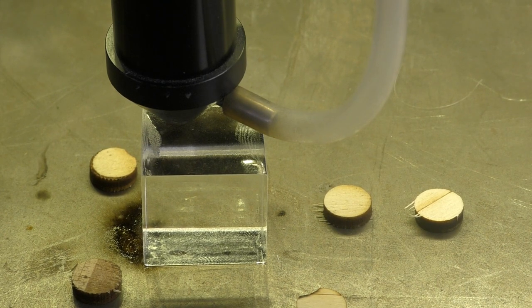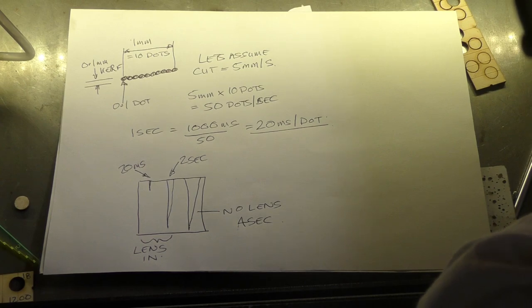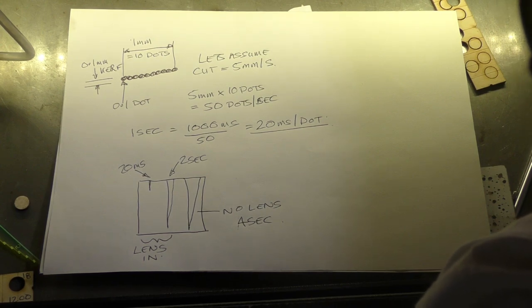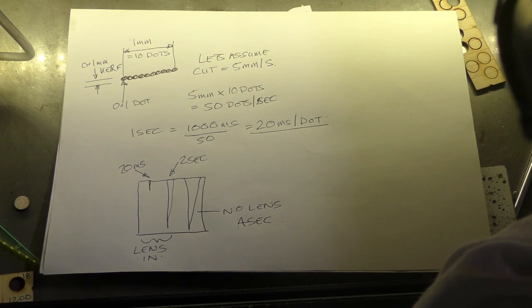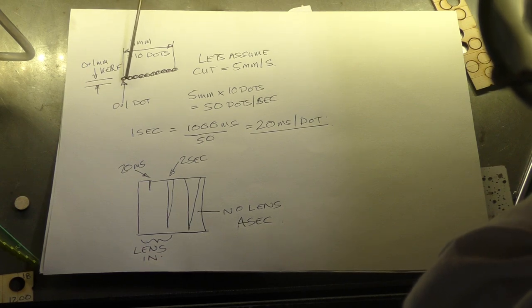That told me something about the sharpness of the beam and the high intensity that goes through the center - very important for cutting. This tells me exactly the same thing. I've got a very small high-intensity beam and it's cutting extremely well as I anticipated. Now I've got to investigate what's happening at 900 - why have I managed to get such high cutting power there when at 700 the mode burns show 700 and 900 are not far apart? We're going to look at several different aspects of this beam - we've seen the real cutting ability, and now we can see something about it by piercing a block of acrylic.